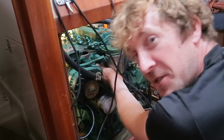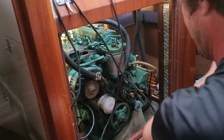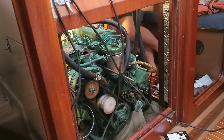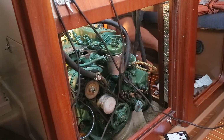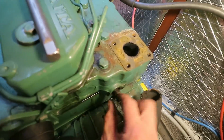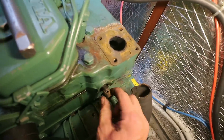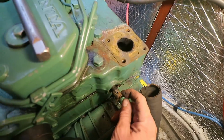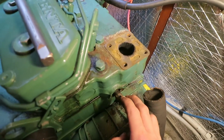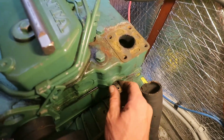Oops, I've just managed to hammer a socket into there. There are 2 holes visible at this stage, one of which faces directly upwards and the other one which points out here 90 degrees to that, facing starboard. When I come to reinsert this distribution pipe, it's specified in the manual which way the holes need to go. Not these holes, it's the internal ones, but I will be able to use the position of these 2 holes as a reference anyway for when this is going back in.